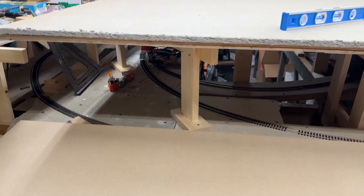Before I lower this down, I figured out I had to add extra support because I only had one holding the cross brace in — this would have collapsed a little bit. So I put a brace here, here, and there. I'm going to cut here, here, and here and then drop this down. I said in the previous segment I had to drop down two inches — I measured it at about an inch and three-quarters, so I was close. I'll cut these, unscrew them, drop them down, and do the center one first.